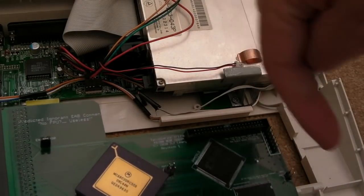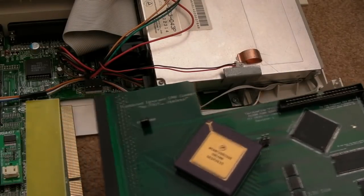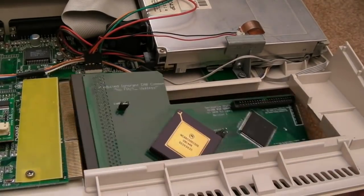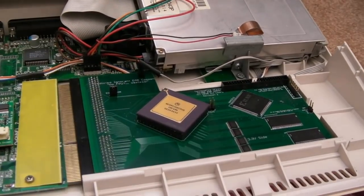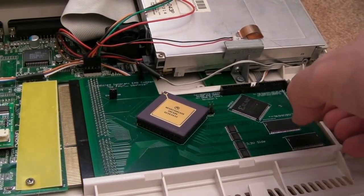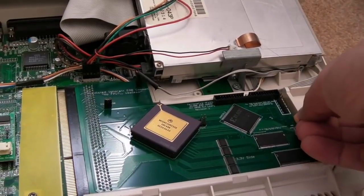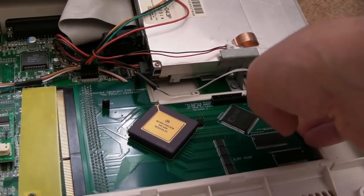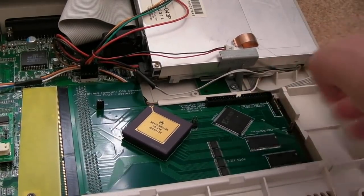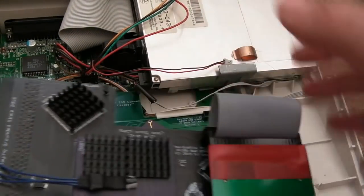So I'm going to detach the IDE from the TF1260 and we'll connect it up here, and it should just boot actually as normal. Let's just move that out of the way. Now this card, I just find so much harder to get in. Let's just see what happens this time. Yeah, can you see that? It's like the slot compared to the other one, there you go, is much tighter. I don't know why. There must be some variance on these things here.